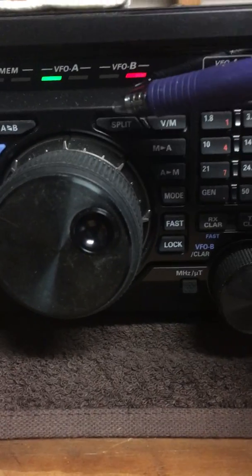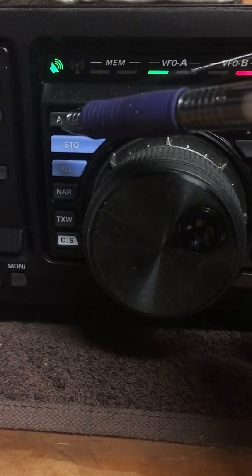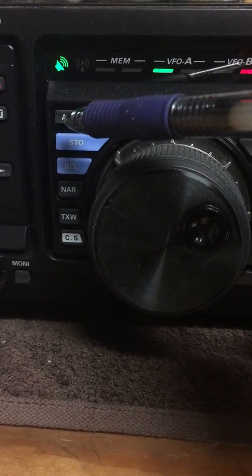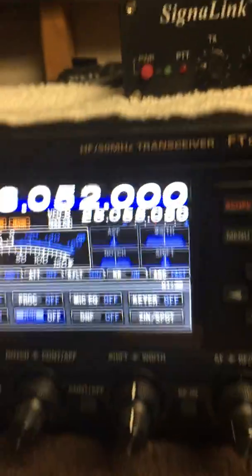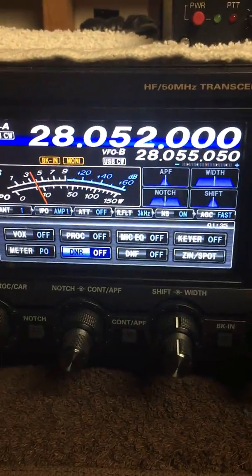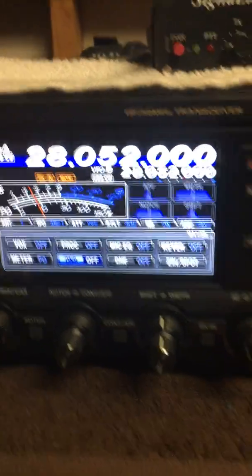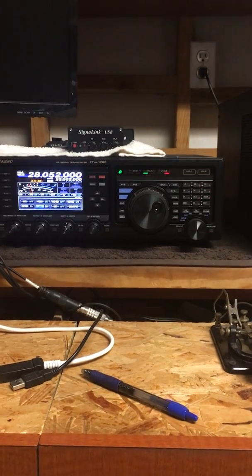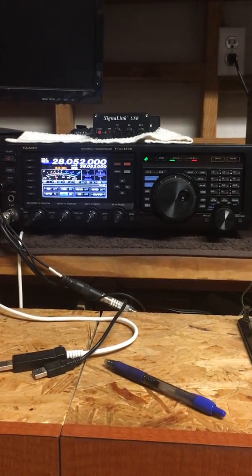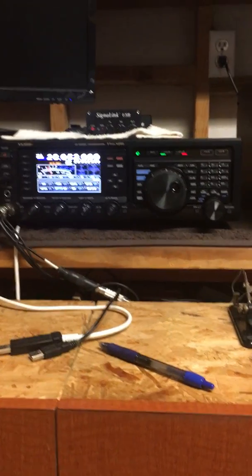All you have to do is use this split button — press it one time. If you want to equalize the VFOs and send VFO A's frequency to B, hit the A-equals-B knob and that frequency will change to match. Let me do that again — I'll push the A=B knob one more time and you'll see the frequency jump back to 28.052. That's it for the lesson on the FTDX 1200. I hope you enjoyed it — split operation. Good luck and lots of DX to you, 73. This is KK4WX in southern Georgia. Good DX folks, see you next time.